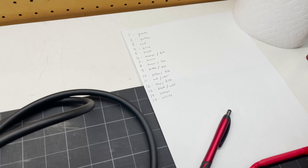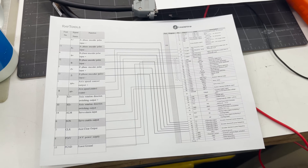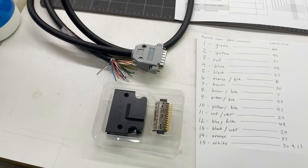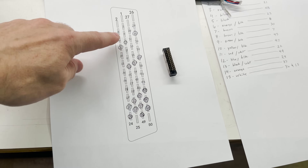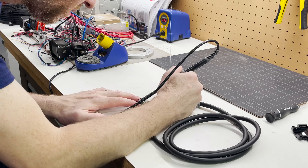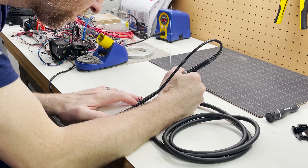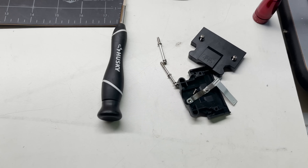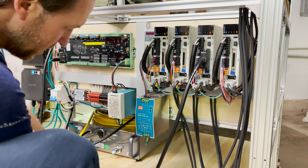I've mapped out all the colors to the pins, so let me make a little wiring diagram. On my computer I've mapped out all the pin connections and I'm writing them down on paper to make it easy. I've made my cheat sheet — let me get this connector all soldered up. I've also mapped out all the pins I'm going to be soldering on this connector so I can do the inner rows first while I can access them and work my way out. All of this pin mapping and wiring took several hours, which is a really good reason to go with the EtherCAT version of the drives and controller if you have the option — you could just plug in an Ethernet cable. I've got all four cables soldered up, so let's get them hooked up to the drives.